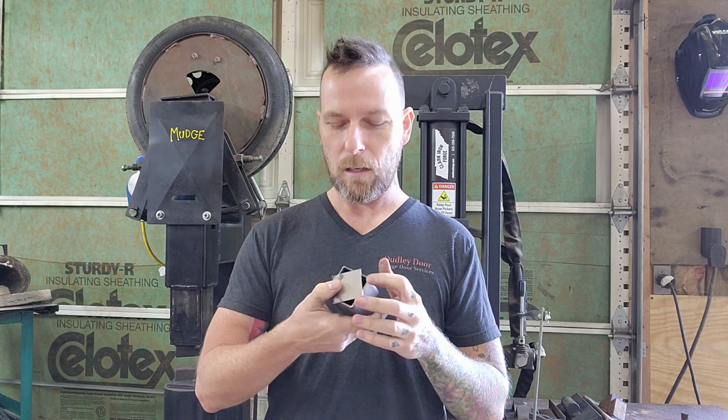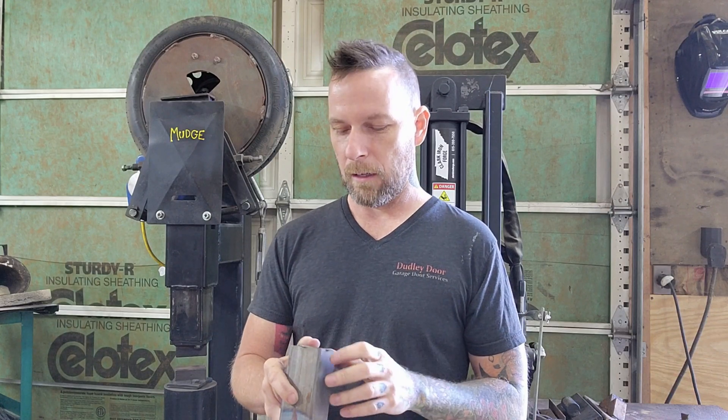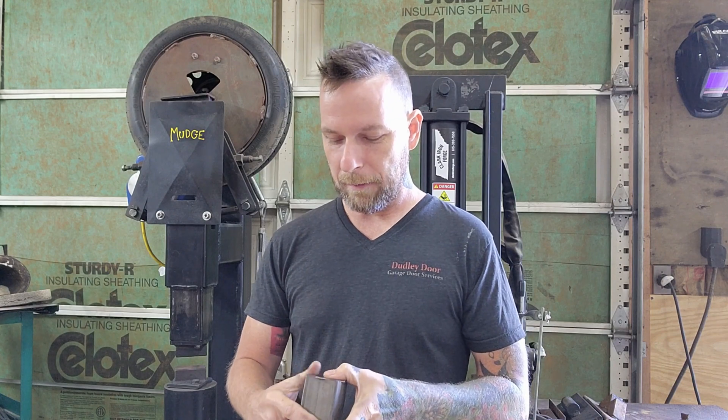One thing I do know is that I'm not going to fill this with white-out or white paint and then try to peel off the canister after we get it smashed together. I've seen bladesmiths struggle with that and it just seems like a big waste of time. This is only a sixteenth of an inch mild steel — it shouldn't be too much of a hassle to just grind it off the core once it's all together.